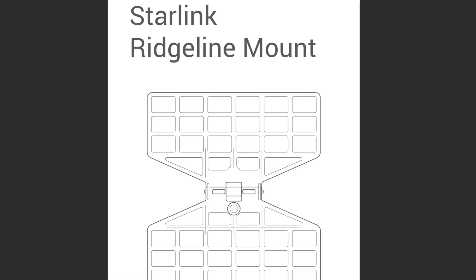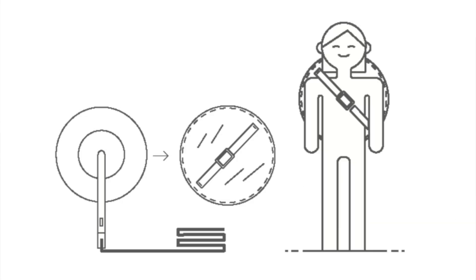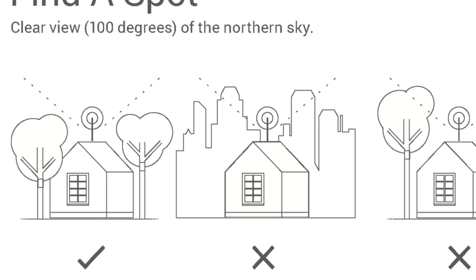So overall, I'm pretty excited by this. For the ridgeline mount and the volcano mount, I've also got the PDF installation documents linked below in the description that goes through more details of what they look like and how they actually get mounted. I'll put out some screenshots here — you can see what the overall mount looks like and the other components that come in the package. I love the bag to put the Starlink user terminal in so you can get up on the roof without risking dropping it. There's also guidance on choosing the mounting location, and you can see it highlights the viewing angle of 100 degrees side to side — so 50 degrees from vertical in either direction — corresponding to an allowed 40 degrees from the horizon in terms of the transmit angle up to the satellites in orbit.